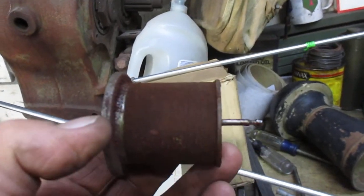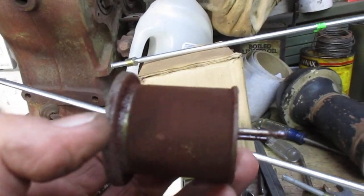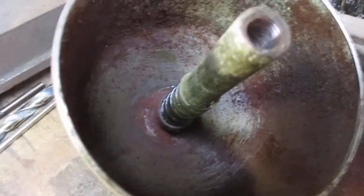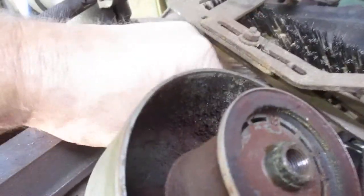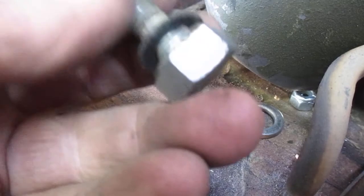I don't want to take that apart, but there are probably about 250 little brass discs that are perforated and strain the fuel. Any sediment that enters the fuel strainer will drop down into the bowl, and the fuel strainer itself sits on top of that spring. There's a washer — a little rubber washer — that goes on top of the bolt right there.